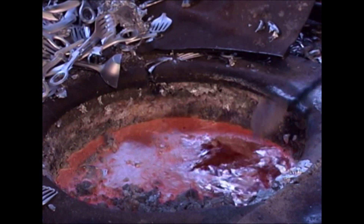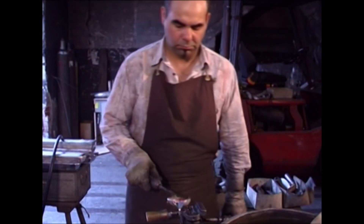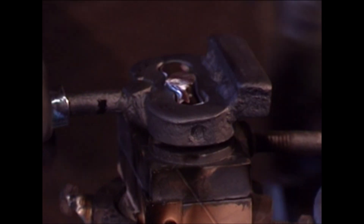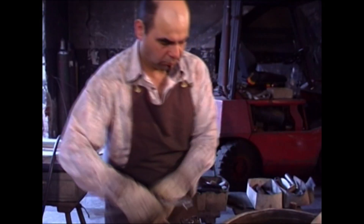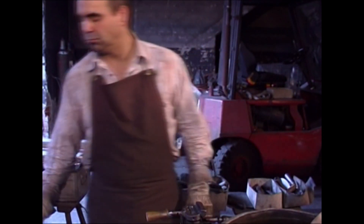The aluminium alloy for the chilled casting is several hundred degrees hot before it is poured by hand into the mould. Many cast parts of the steam engines are made using this method — machine frames, axial supports, and other small parts of the steam engines. These parts are made of cast aluminium.